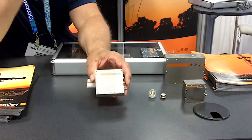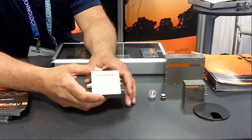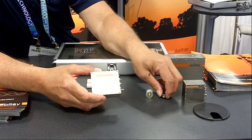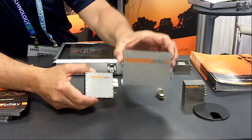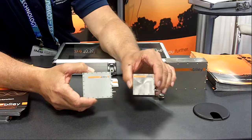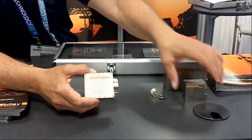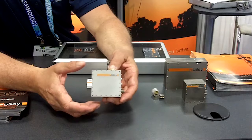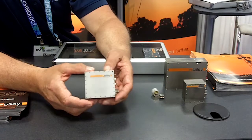Ultimately, we've developed a device that integrates all these techniques to nullify the effects of G-sensitivity — what we call the Poseidon 2. It has an SC cut quartz crystal with a four-point mount to nullify microphonics and smaller vibrations. We've integrated a large plate, and reduced its size because the electronics can handle sensitivity nullification up to 350 or 400 Hz. This is our Poseidon 2 — a turnkey solution for vibration G-sensitivity compensation from 10 Hz to 2 kHz, the full bandwidth of the military frequency range.